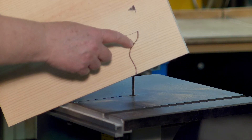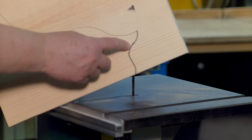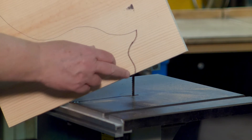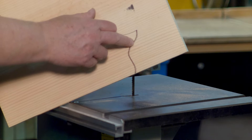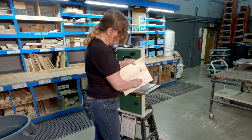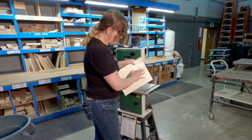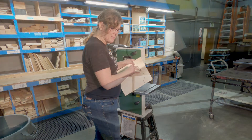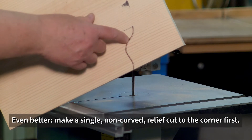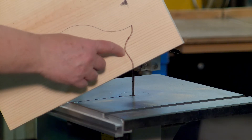The little facet cuts, the tangent cuts — I could probably have cut straight in and then come in from another angle and had more control. I had a couple of different options. I thought I could make this turn just fine, but it was a little tight on this outside curve. I wasn't turning right — I was advancing too fast without turning. You can't turn on the spot, but you can turn slowly and progress forward. I probably could have gone straight into the corner for a less complicated backing out, and then come back to clean that up.